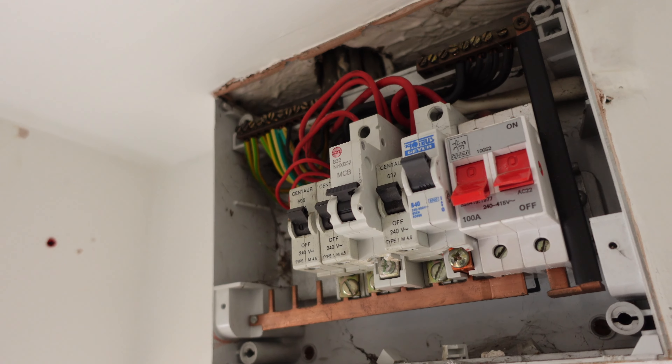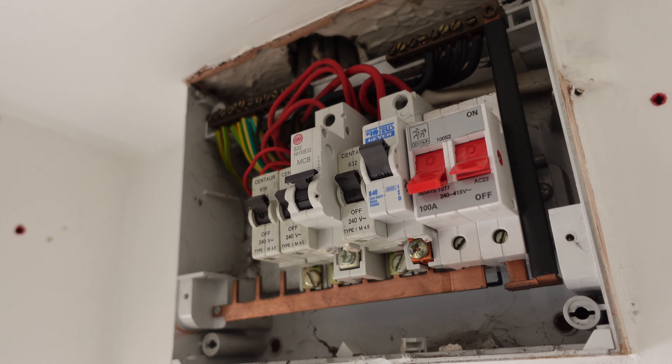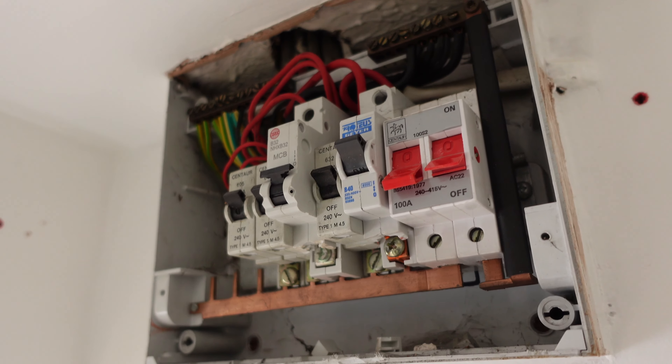That's my point. What I'm going to do now is strip it all down and do an insulation test on all the cables. Everything's unplugged, everything's turned off. We're going to test that now, check that they're all within the limits, take the ring readings and put the new board on.